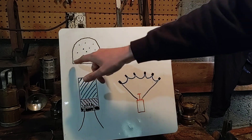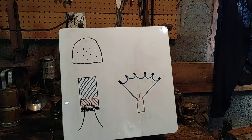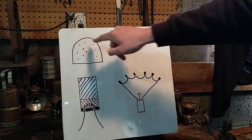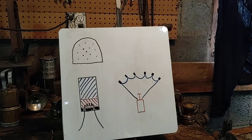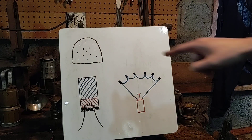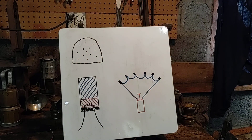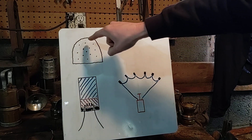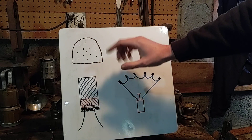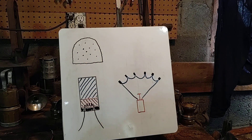Imagine a tunnel in hard rock — it's extremely hard to do an undercut and you're not going to do one. With all the dots as loaded shot holes, if you set them all off at once it would be absolute destruction with stuff flying everywhere and damage you didn't want. But with a time-delayed cap you could set the center hole off immediately. It blasts out and blows material straight back — not ideal, but now you have a hole in the center acting as pressure relief, like an undercut. Then you set the next four holes off around it and they pull to the middle. Then you delay the outer holes for last — with a big hole in the center those all pull inward. That's called a center pull shot.